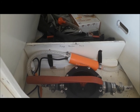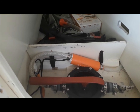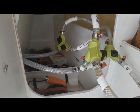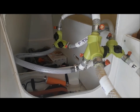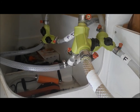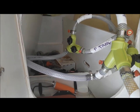The other thing I had to do was remove all air leaks from the system, because if air gets in, the centrifugal pump will fill with air and stop being primed. So I put hose clamps everywhere — there are no longer any hose pieces with quick-connect rubber rings. That whole easy-removal system has been taken out, and I'm now stuck with a permanent system with hose clamps doing the job.